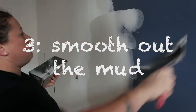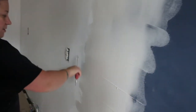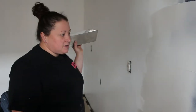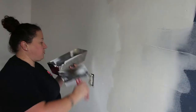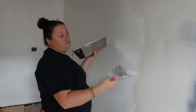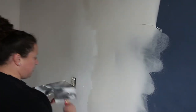Now I'm just going back again to smooth out what I just did. You can worry about these little ridges now or deal with them later. For a smaller area like this, I'll pull them out now. But if you're dealing with a bigger project, when these dry you can just scrape them down. If it's a huge divot, you'll want to go further across. Any extra mud left over, just clean up the area.